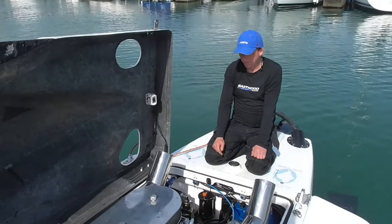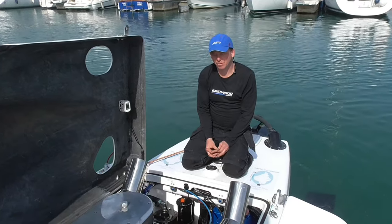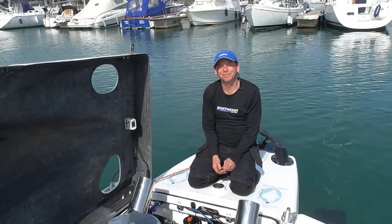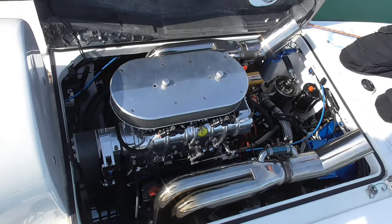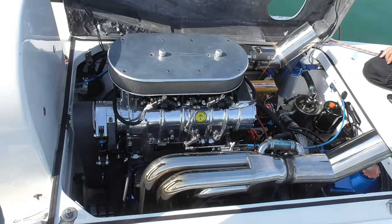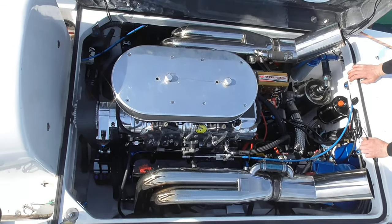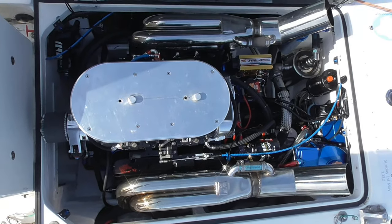What's the actual spec of it all then, Gary, like big block and all, 555 that sort of... Cubic inch big block, 1000 horsepower, supercharged, loud, very loud and pretty thirsty, but simple, nice and simple. So it runs a really basic ignition system, runs a big capacitor discharge ignition, no movement on the timing, it just runs a set timing, and a couple of giant carburettors. Just old school.